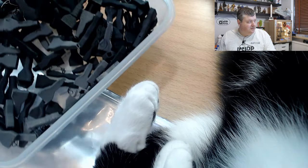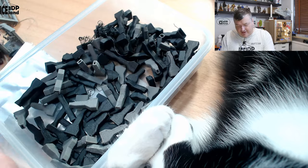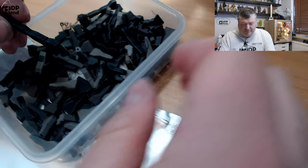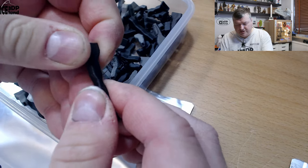As it's a nylon filament, it's sensitive to moisture. I printed the material straight from the sample bag — it was a sealed bag. If you have this filament, you should try to dry it out before using. I spent quite a time printing out layer adhesion samples to compare layer adhesion compared to other filaments. I print them out and break them apart in my break test machine and measure the force needed to pull the filament apart. The machine basically pulls the filament apart to see how much effort is needed.